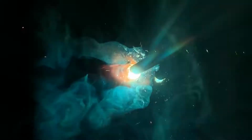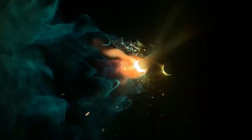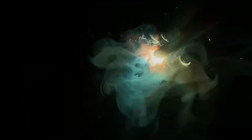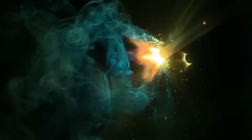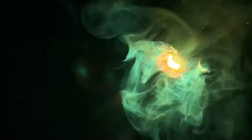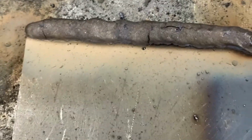You can also see that we are trying to hold a very tight arc. That's the distance from the rod to the plate while we're welding. Most of the time you want to use the same electrode diameter as the rod for your arc length. So if this is a 1/8 inch rod, we would want to use a 1/8 inch arc length, or resting it just on the plate works fine as well.